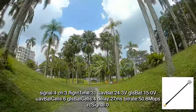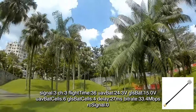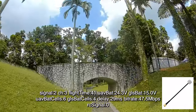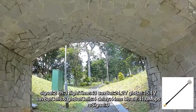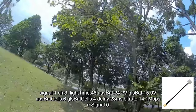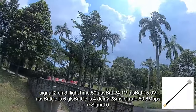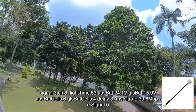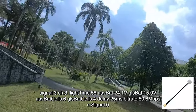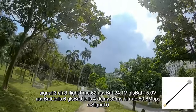In the next flight test, the TBS long range antenna was used. At the point where the stock antenna started showing lower bit rate and higher delay time, the TBS long range antenna was holding pretty well. At the frame hold point, we note that the bit rate has dropped and the delay time has increased, but it resumed back to almost near normal level pretty quickly.